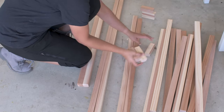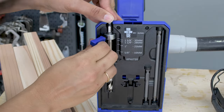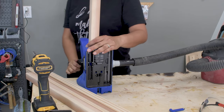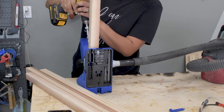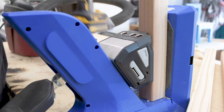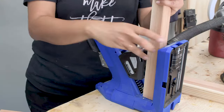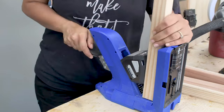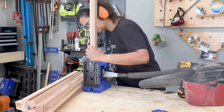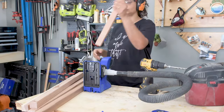Once the cuts were made, it was time for the pocket holes. My redwood boards are an inch and three-eighths thick, unlike regular two-by-two boards, so I adjusted for it on the drill bit collar for the pocket holes. Then I just went ahead and made all the pocket holes. I am using the Kreg 720, but you can use any pocket hole jig. If you don't have a jig where you can adjust settings of the drill bit collar or the height of the jig to an inch and three-eighths, you can set the jig at one and a half inches and set the drill bit collar slightly below the one and a half inch mark and make some test holes. As long as you don't see a hole indent on the end of the board, you should be good to go. It is a lot of pocket holes, but my plans call for exactly where to make them.